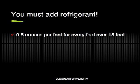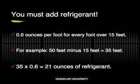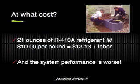Consulting the manufacturer's chart, we see that you would need to add 0.6 of an ounce per foot for every foot over 15 feet. For example, 50 feet minus the factory charge for 15 feet equals 35 feet. 35 feet times 0.6 of an ounce equals 21 ounces of refrigerant that you would have to add. How much cost will this add to the job? Well, if we figured $10 per pound for R410A refrigerant, 21 ounces of it would be $13.13 plus your labor.